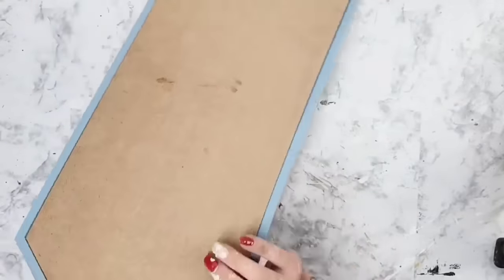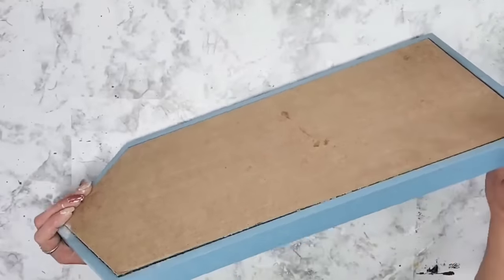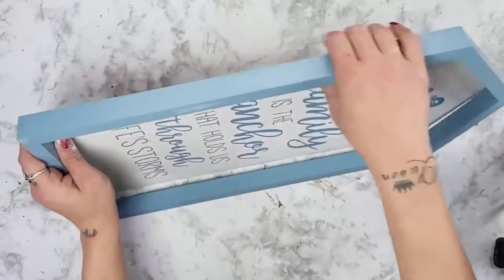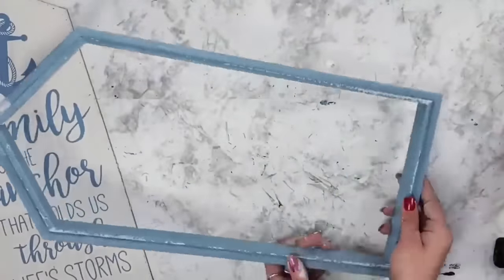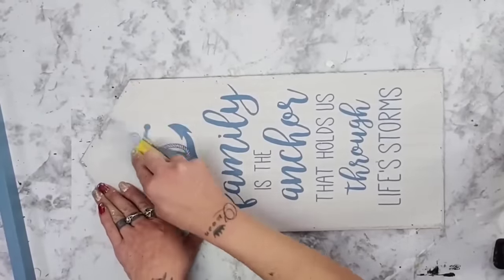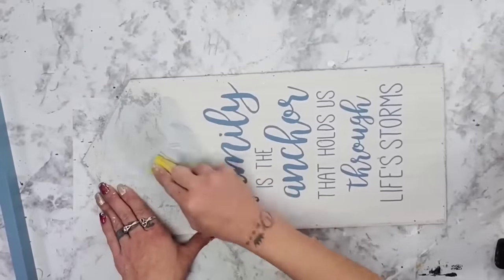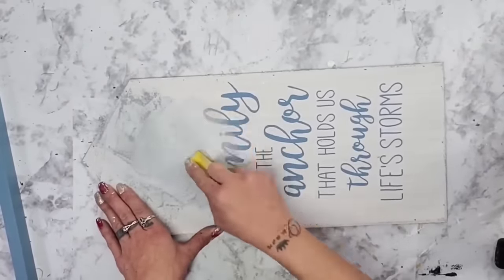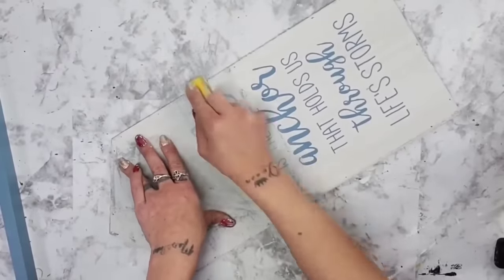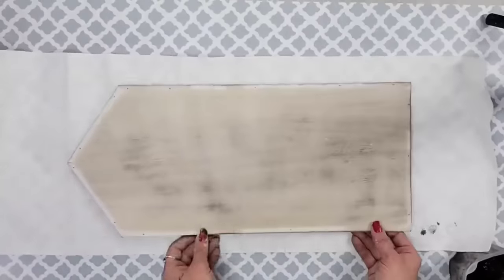For this house piece I removed the hanger, added some Dollar Tree spackling to fill in the holes, and used my thumbs to push on the corners to pop the backing out. I wanted to get rid of the lettering, so I took my zip sander and started sanding a lot of that lettering off. As I was sanding I realized the paint was coming off very easily, so I sanded as much as I possibly could to get the wood grain popping out.